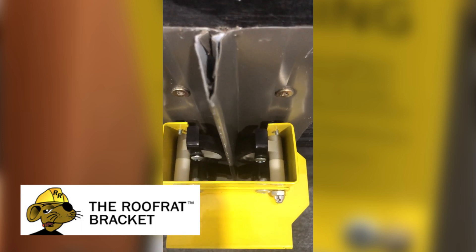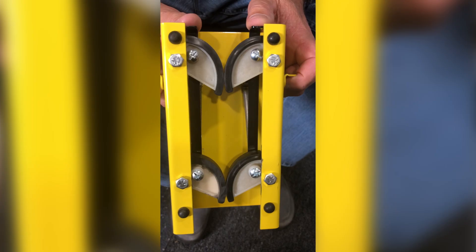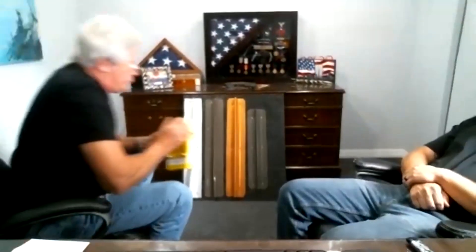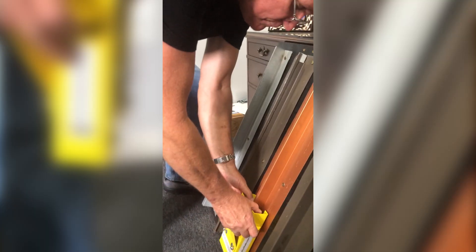So how does that product actually work, what does it look like? I have one right here. This is where you would put your foot and you press these levers and it opens up a cam system. The cam is applied to the standing seam and as you step on it, it just gets tighter all by itself. I have a sample board with some different profiles on it — I'm going to go over and just put it on for you. You just press the levers — that's an inch and three quarters snap lock.